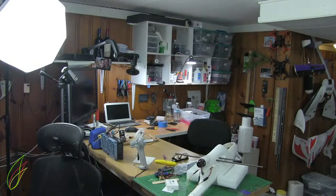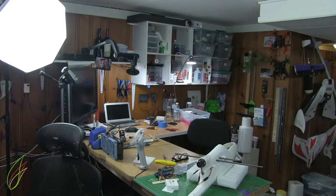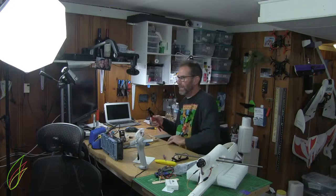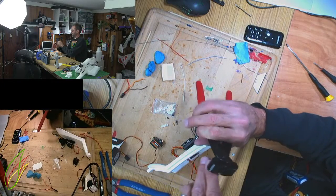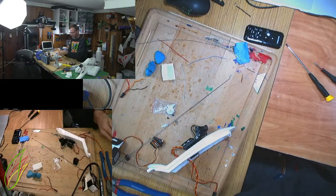Okay, so now all we need is a little piece of control rod. And we're going to take it from this. I put the tools away too quickly. We get some tools and Z-bender tool. Of course, one of these days I'll edit this down. Okay. So let's do 7. And then, okay, we're going to do a Z-bend on the end of this. Like that. And we'll cut it when we know how long to make it. Oops, I forgot to put these away.